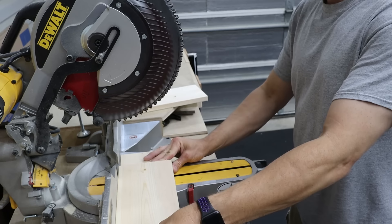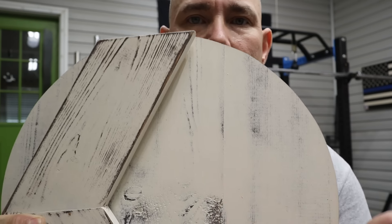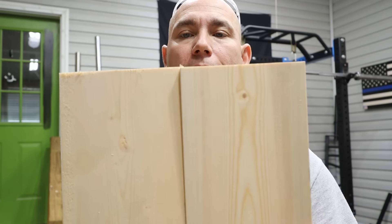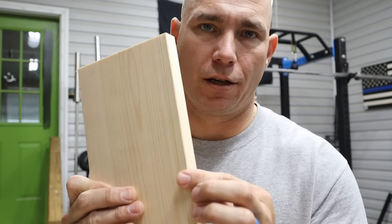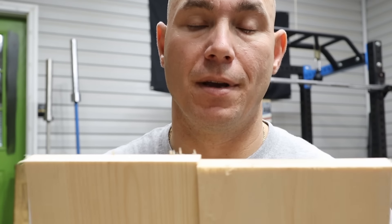I'll just lay that 14 inch piece on top of the other one. You can join these with a table saw — link in the description below to that video — if you want that real tight seamless joint. You can see that seam, but it is a very tight joint because those edges were jointed with the table saw. For a more rustic look, or if your board fits together pretty good, I'm going to leave that seam in there. This one by six has a little bit of a rounded edge from the factory, so it'll give a slight indent where they join. We're going to join these together — you can do it with glue if you've got a nice tight seam and can clamp it.